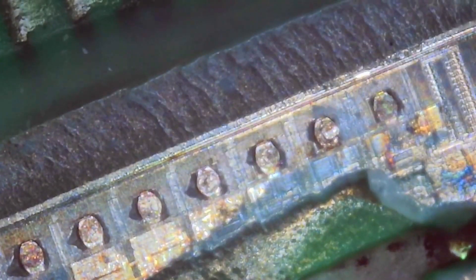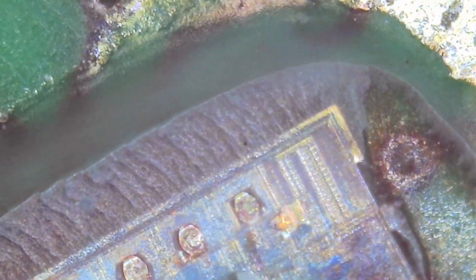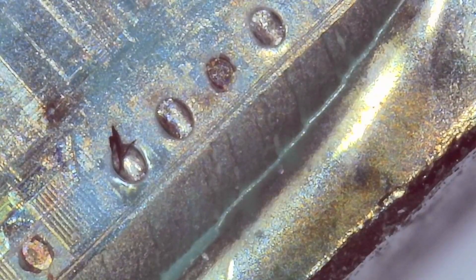This is now at about 1000 magnification — or 700 — but you can see where it's totally blown off the top of the die, and it literally looks like a piece of glass. That's because it is glass, sort of. It's silicon — sand, glass, all the same thing. This one's just arranged in a really nice way, obviously doped and all that, photolithography et cetera. But you can see the damage — it's actually exploded the top layer off, and it makes it really unique.